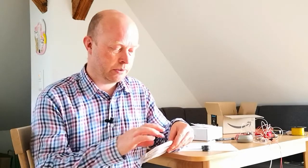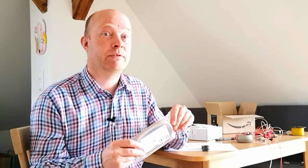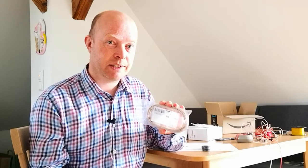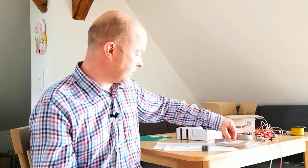But the problem with this coax is the sheath. The PTFE sheath is very, very delicate, and if it's out in the sun day after day, it will soon split, and then you'll get water going into the coax and it will start to corrode. So for a permanent installation, I would have a look at different types of RG174. There are some with coatings that are specifically UV resistant, specifically developed for outdoor installation, and they're much better. So you might be tempted to go for a very high quality PTFE coax. I would advise against that if it's going to be a permanent installation, and go for a good UV resistant RG174. The difference in impedance I don't think is going to affect the antenna. So that's the first thing. You'll need enough coax.